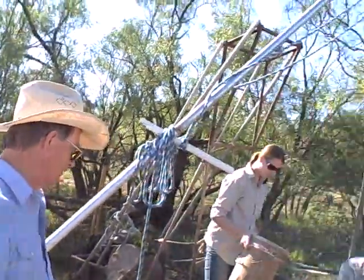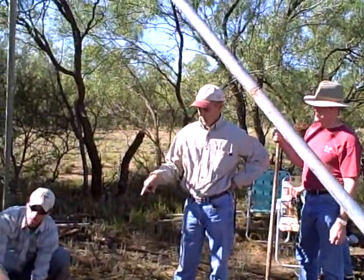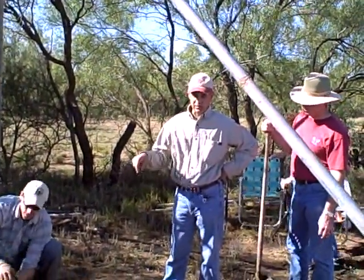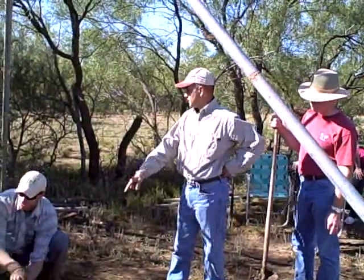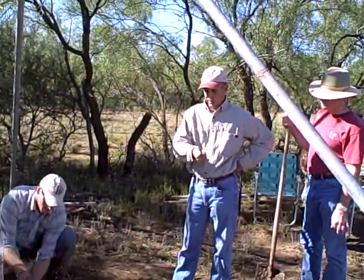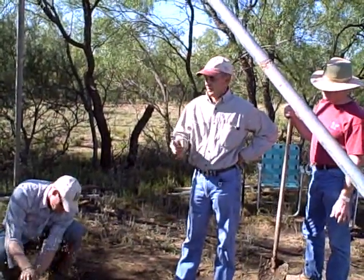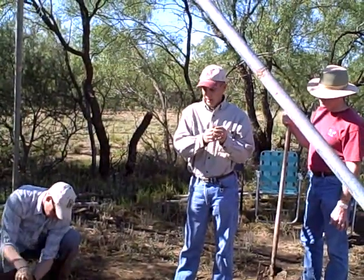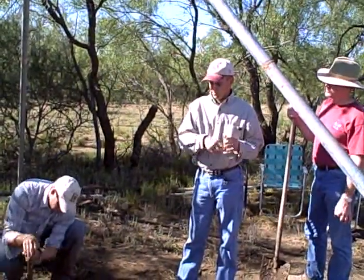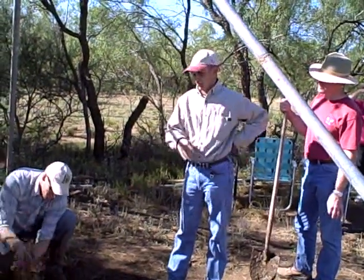What he's doing now — when you drill, one of our little setups is real simple. It's just like the cable tool, except we replace the cable with plastic drill tools. And that allows us to get reverse circulation up through this thing. Everything else is the same. If you're going through unconsolidated material, you've got to add clay or sand. If you're going through pure clay, you send it out and add fresh water instead of clay in there.